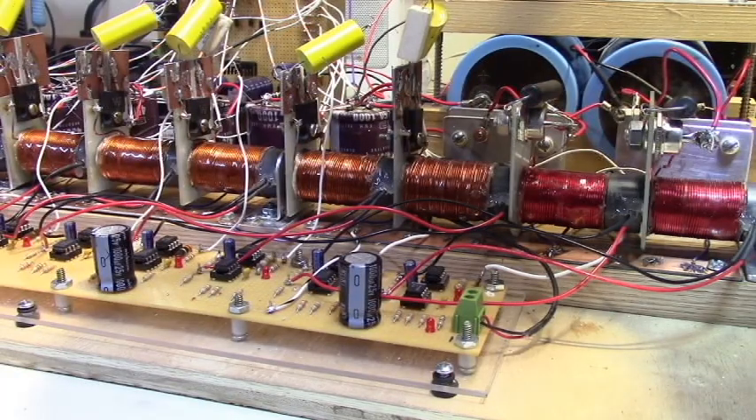The conclusion from this series of experiments is that a slightly shorter coil, a little more inductance, and we do not need advanced trigger timing.